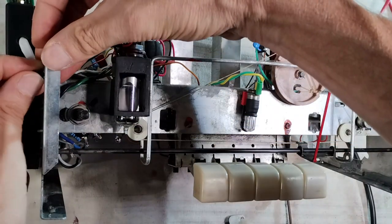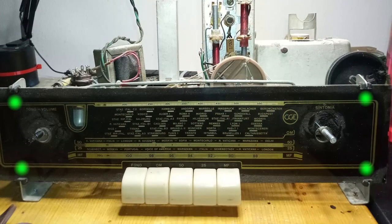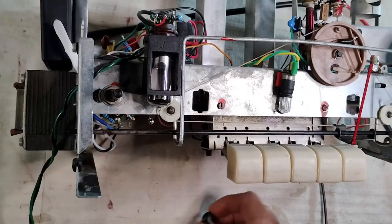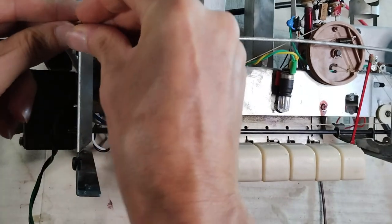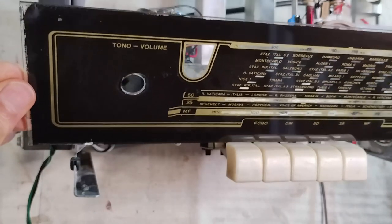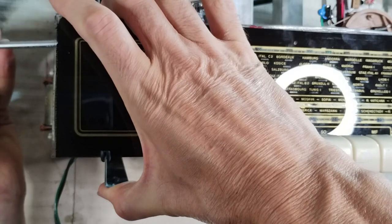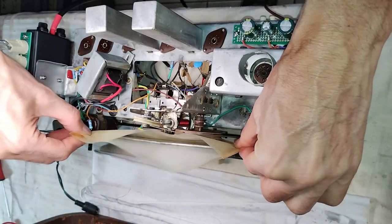This video clip shows how to install the dial glass. The metal pins that would hold the glass had special grommets that have become very hard by now. They have been replaced with pieces of regular round grommets. The diffuser should have been installed before the dial glass.